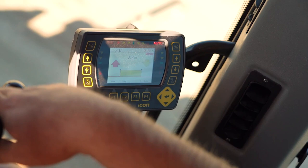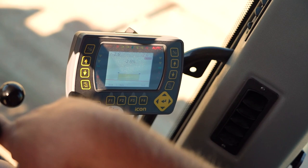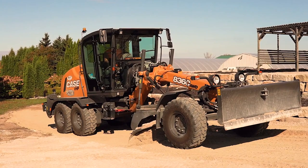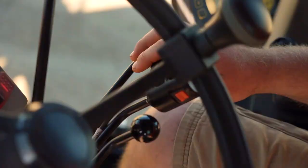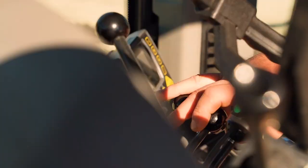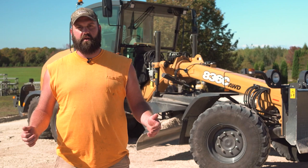The Leica system controls our grade and slope — it will lock one side in, setting my grade at 1%, so I don't have to watch both sides of the moldboard. Way more comfort, not so much head movement. Every time you grab the lever you can feel that hydraulic pressure and you can feel when your moldboard is moving, not relying on other controllers where you don't feel that — you're relying a lot on just movement and looking.